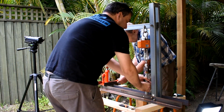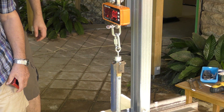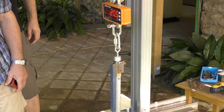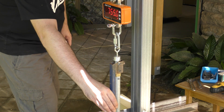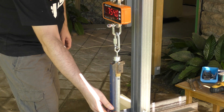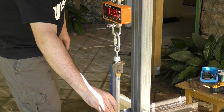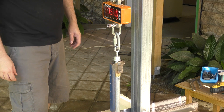I'm going to be referring to kilos of weight equivalent rather than newtons when describing forces, as that's easier for people to relate to. At full pressure, the booster will exert about 700 kilos on the release head — that's like hanging a Formula One car from this mechanism. Here is the first test: we bring the load up to around 750 kilos and the release mechanism is absolutely stuck, and no matter how much we pull on it, it just won't budge.